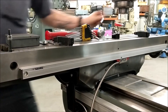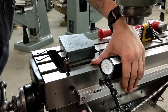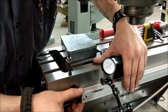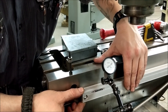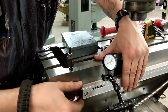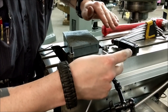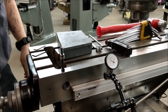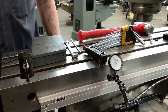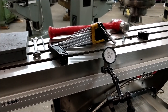If you have it off more than 10 thou, you will run into issues. Just to show you — even with pre-drilled and tapped holes, we've got about 30 to 35 thou of play right there. Just because there are pre-drilled and tapped holes doesn't mean you don't indicate it in — you always have to indicate it in to get it flat. When you're doing this, you're going to have a big dip in the middle and we're going to show you how to correct that via some hardware they send in the kit.